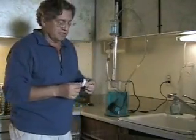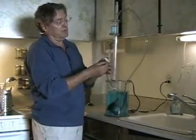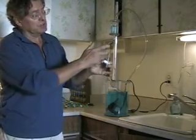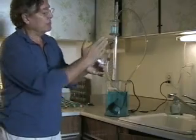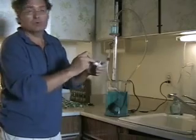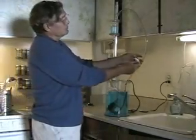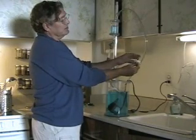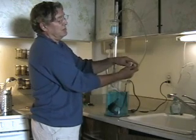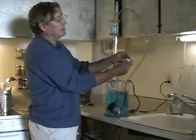I'm going to install this three-way valve in this line. This valve has three ways of channeling fluid: go straight from here to here, let the fluid go right by, or the fluid can come up into this exit point from this direction or from that direction. If I want the fluid to go straight by, the valve handle will be in this direction. If I want the fluid to come out through the middle port, I will just rotate the handle.